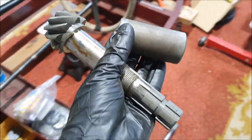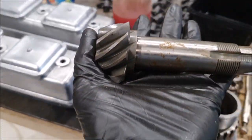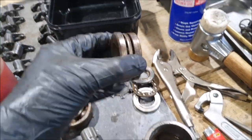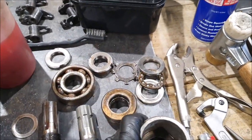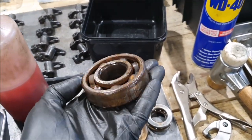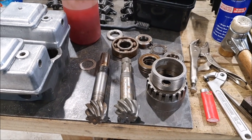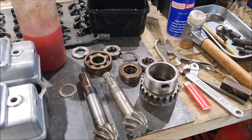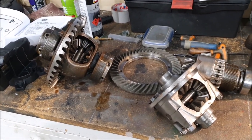It's another one of these differences between the different marks of Riley. Without having stripped down a reference car apart from the parts car, it's really hard to know how all of this stuff is supposed to go together and which bits go together. This is the big thrust bearing that came out of it — inside this one housing there are two thrust bearings and two roller bearings, which I did manage to get out. I'll do a bit more research; if anybody knows, please let me know. I guess I just have to do a test assembly and see where everything falls.